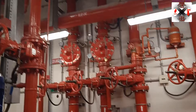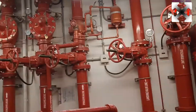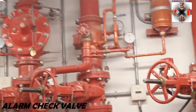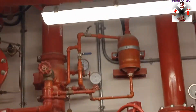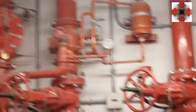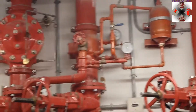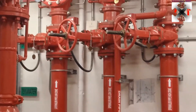These are the inscriptions written on the lines, with their pressure regulating valves — PRVs. The high zone has the alarm check valve, with the retarding chamber going to the mechanical bell outside. Whenever that bell rings, it gives an indication that there has been a pump run, which is very important — so whenever you hear it, you know the pump has run.